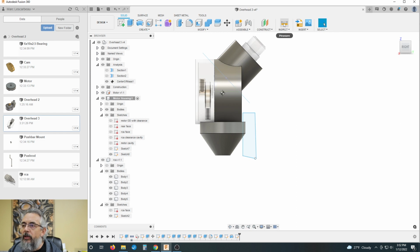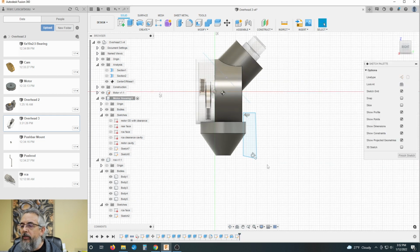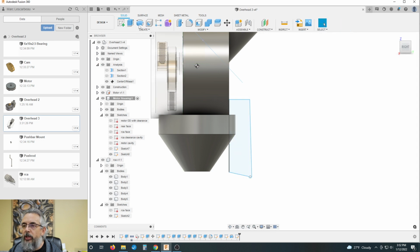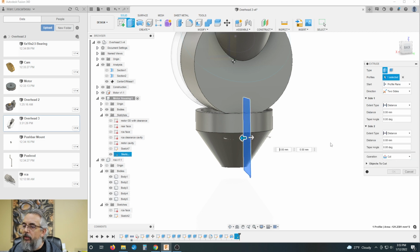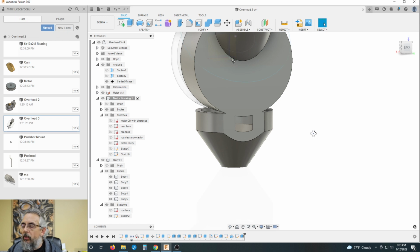Finish sketch. Measure the distance from known datum to face, 13 millimeters. Close. Back into sketch. Dictate this line to be 13 millimeters off that face. All right. So perpendicular, perpendicular, blah, blah, blah. Doesn't need to be any great shape. Extrude in a cut fashion. I'm centered, so I'm going to go from the profile plane, two sides. I'm going to pull it this way a bunch, and this way a bunch. I don't need to be precise, although I normally am when I'm building something.